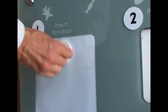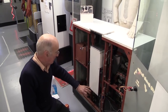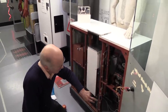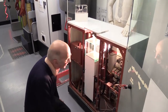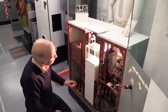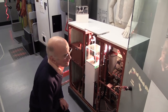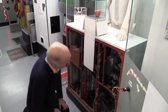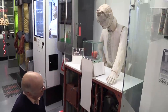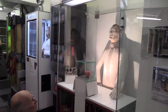On the art expert machine, the hatch goes up and down on a chain drive with three position switches. There's a sensor that detects hands going in, and the hatch travels between the bottom switch, past a middle switch, all the way up to the top switch. The motor that makes the figure lean over also has limit switches at both ends of the motor's travel.